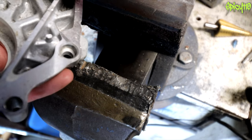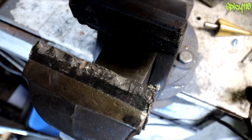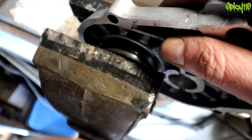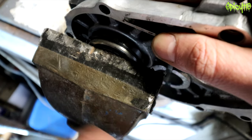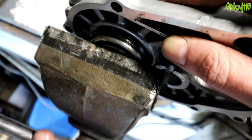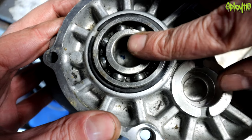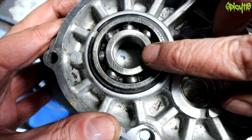This is not how you'd do it for a real machine — you'd use a proper press — but the point is bearings should be pushed in evenly, not hit in. If they kink sideways they can get stuck and damage the seat, so you normally use tools to guide them in. The shaft goes in through the middle with a corresponding bearing on the other side. Inside an engine the open type is great because oil gets inside to minimize friction.